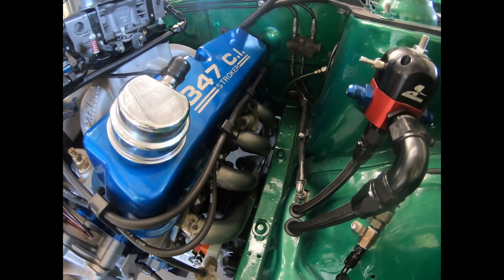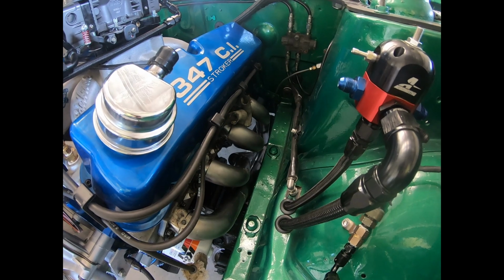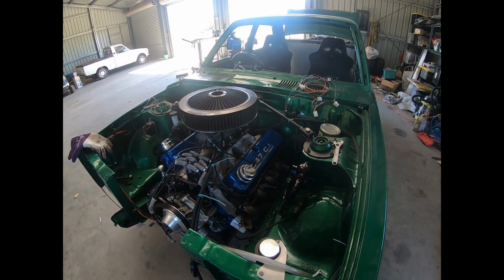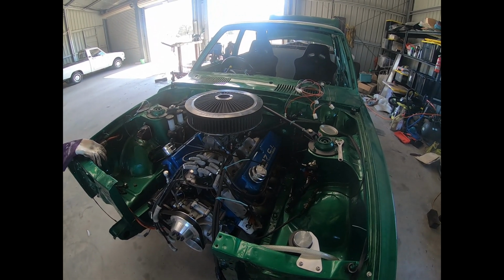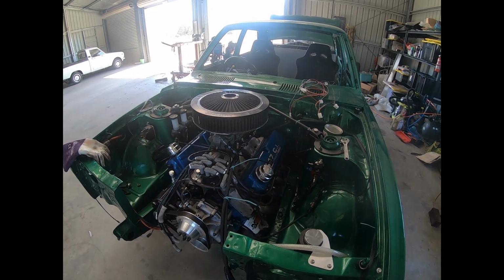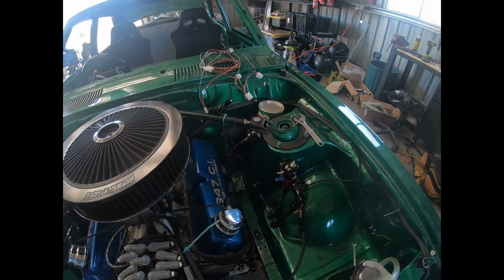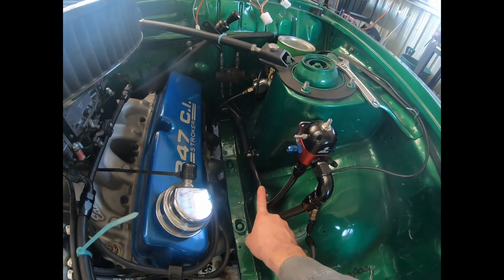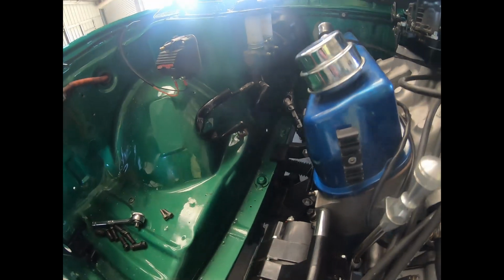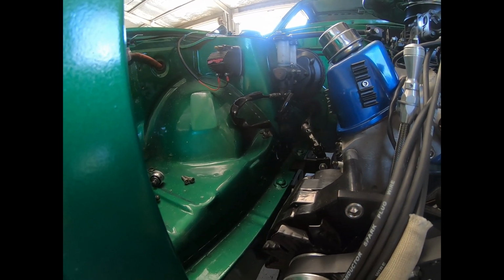Wrapping will just help keep ambient temperatures in the engine bay down a little bit. So the exhaust will be hottest when it's under load. Being a drag car, that'll be in the burnout box, which is only short. And then when I'm running down the strip, there'll be airflow through the engine bay to help keep things cool. See, I've just put some insulation sleeve on the brake lines on both the driver's and passenger side, so we don't get too much heat into the brake fluid.